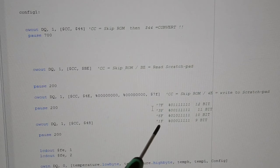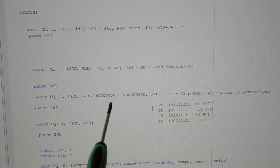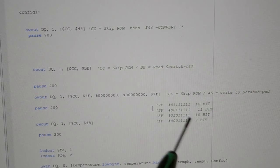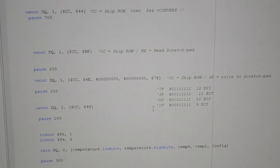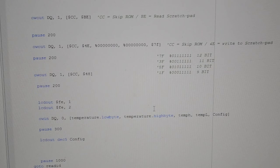If we leave it at 9-bit, on the positive temperature path the math works fine giving half-degree resolution. However, for the negative temperature conversion, we'll still get three decimal places due to the math — we won't get even half-degree steps. So it's up to you: mess with the math on the negative side, leave it at 0x7F for 12-bit, or if you're only reading positive temperatures change it to 9-bit.